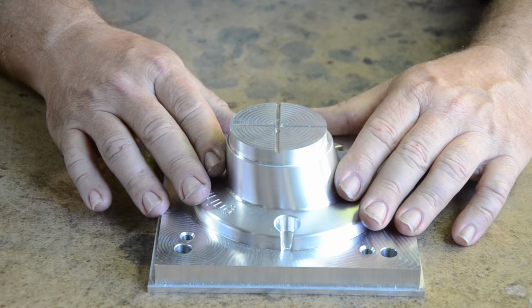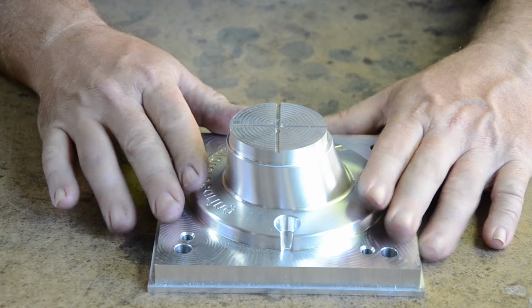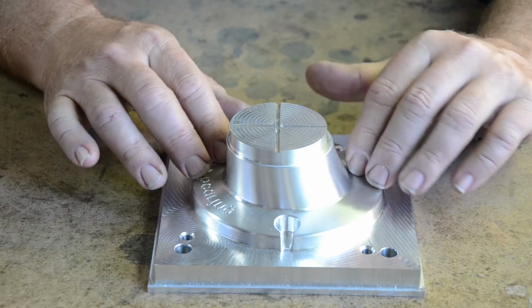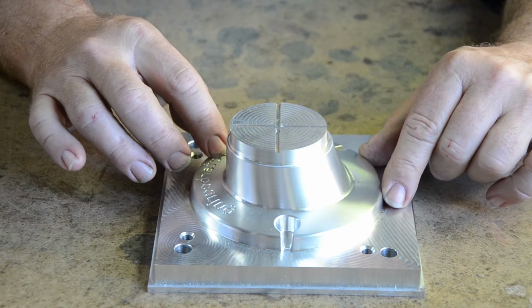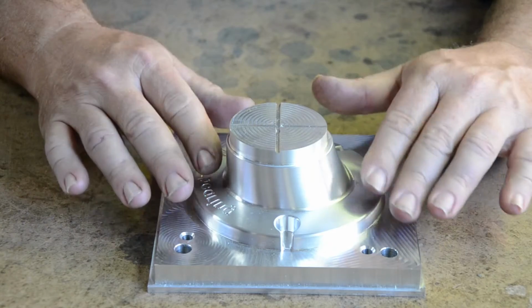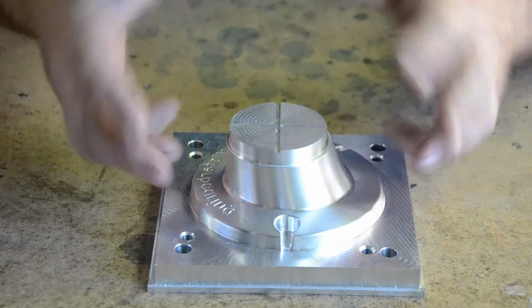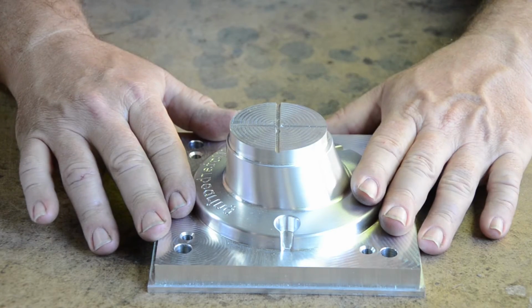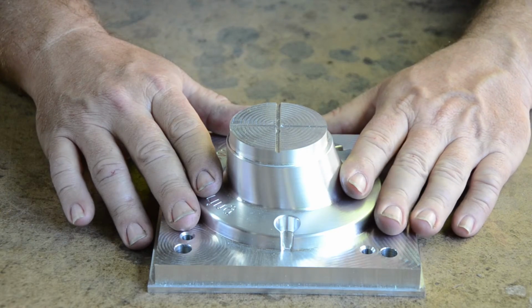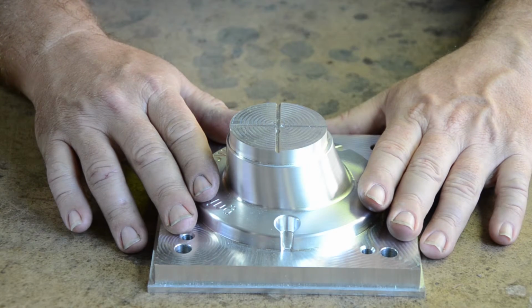The particular surface finish is not that critical because the investment casting process will still probably leave the part rougher than the waxes are that I give to the foundry. But I do want this really easy to use, and I don't want the wax hanging up in the metal. With the silicone parts, if something got hung up, I just torque it, and the wax will just pop out. I can't do this with the aluminum. There's no torquing it. If it's stuck on the metal part, it'll get really hard to remove. So I want to minimize that. So, some work to do.